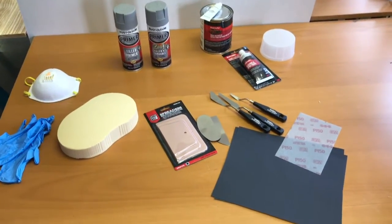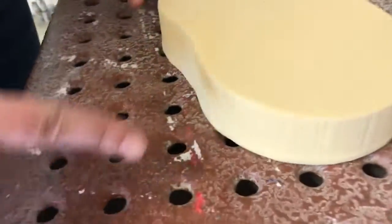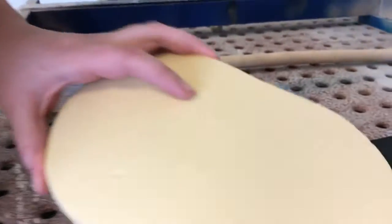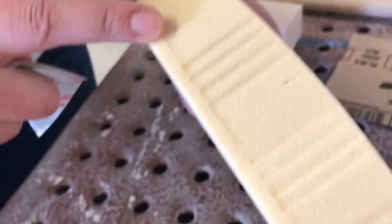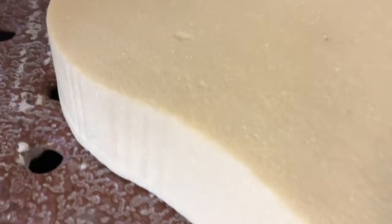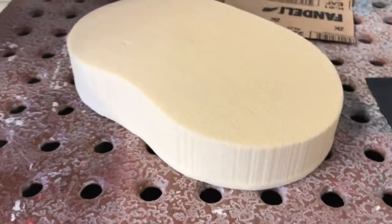When you start working with your urethane foam you can begin making cuts using your orthographic views. Many of you know to use tracing paper to translate those views and then use the bandsaw to cut your form. Right now we have a pretty raw form — on top it almost looks smooth, but looking closely there are chunks missing and striations. On the sides there are definitely major issues where you need to get it down to the true form. If you've made a gouge on the bandsaw that's deeper than your intended line, you can fill it in later, but try to get down to your intended form; if you've gone too deep, leave it for now.